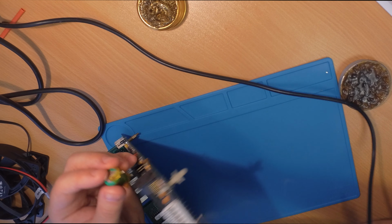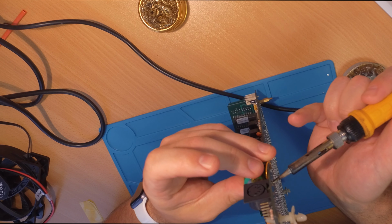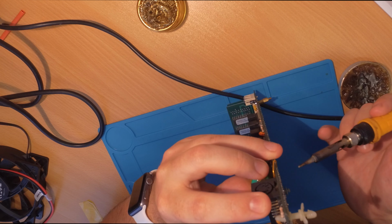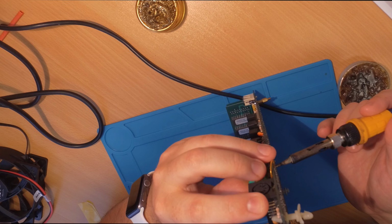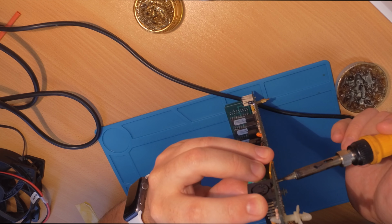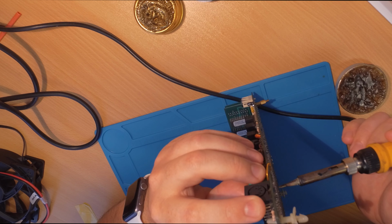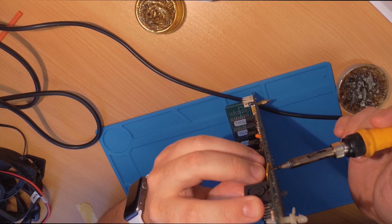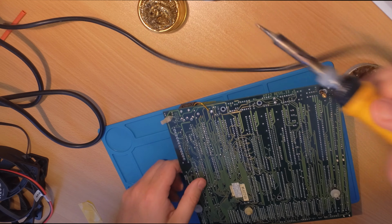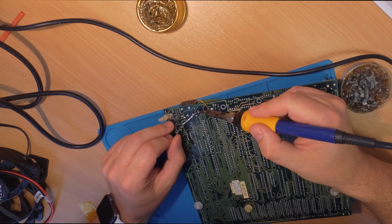You could put a 6, that connector is 6 volts, so you could put 4 AA batteries in a package. One downer with that is I think you will also need a diode, because this header I think also will recharge this battery. That battery should be rechargeable, and if you just put 3 or 4 AA batteries, this board will try to charge them, which will eventually break the battery, and you have to put a diode to prevent the current from flowing